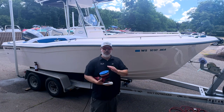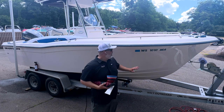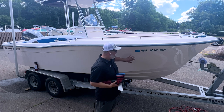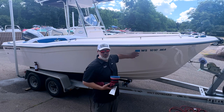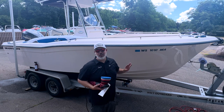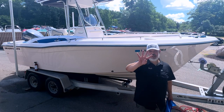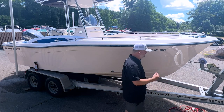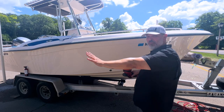We're gonna go ahead and finish cleaning this gel coat up with our HDO Blue Pad. You know, again, for the age of this boat and considering how I use it, I only do this about once a year. Basically what I'm doing here is just making sure I'm cleaning all that stuff off. I'm not really looking to correct anything necessarily. There's my process. Four passes, NSP 95 on the HDO Blue, we're good to go. I'm gonna go more product on so I can cover more areas.